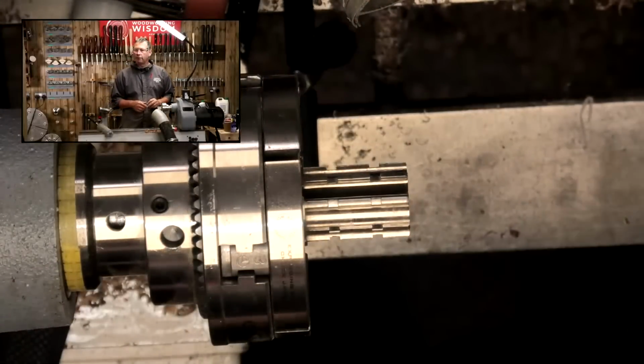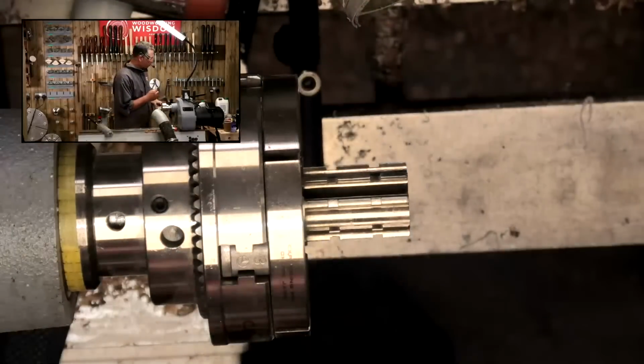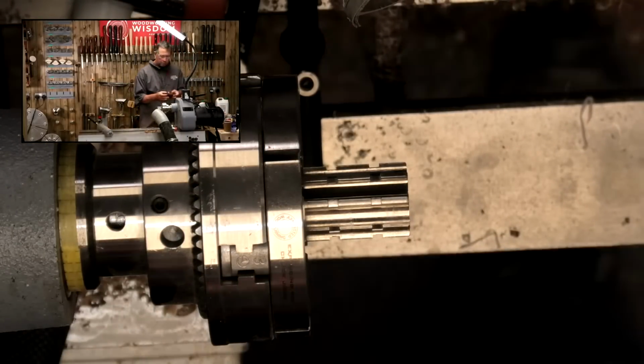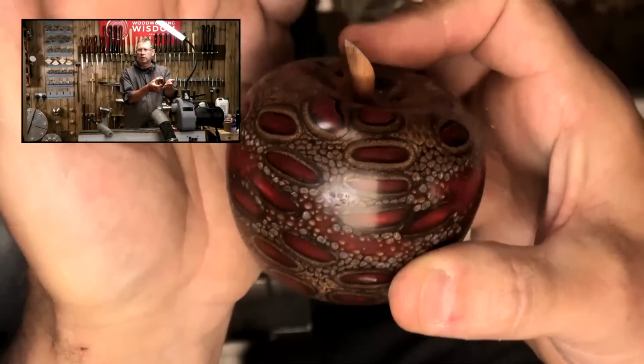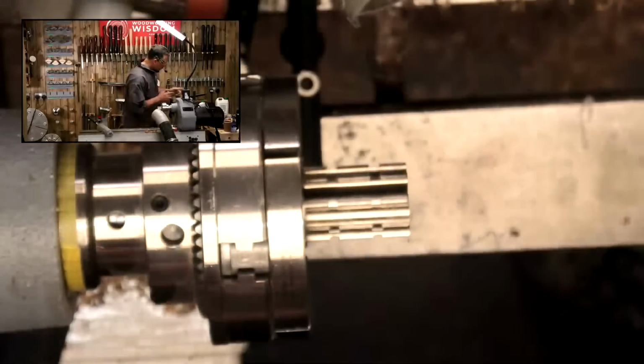Right, there. If you didn't see what was going on, all I'm doing is using that drill bit, not in straight. I'm purposely going in at an angle, and that will then offset it when it comes to putting the stem in. Come the right way, Colwin. That should offset that stem nicely, so you can see that rather than sticking up straight, it's coming in at a nice angle. So I've done that. Now we're going to turn the stems. I'm going to keep the same jaws in.